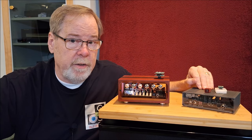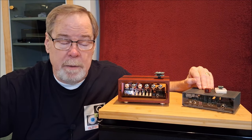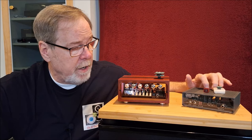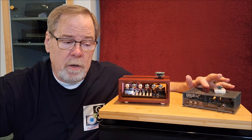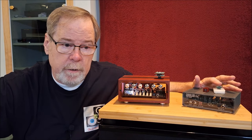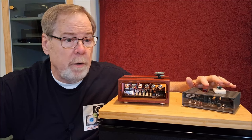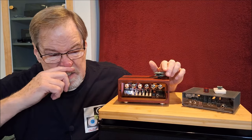They sound great out of the box with the standard TI op-amps — honestly very good. If I never swapped them out I'd probably never know the difference and I'd be just as happy. But swapping in the Sparkos 3602 on single-ended and the Burson V7 Vivid does affect the sound. The Burson is a little warmer through the midrange with no loss of detail — very good all around. The Sparkos is a little more accurate and detailed, with a little more transient decay extension. Both are excellent — there's no winner.